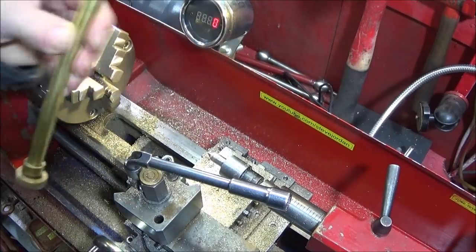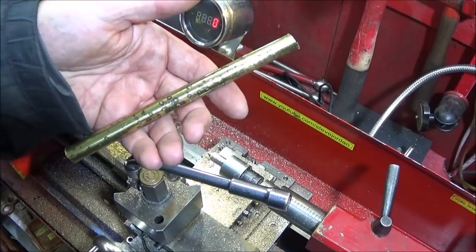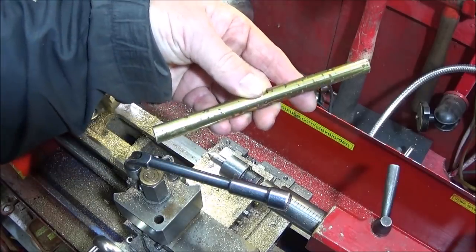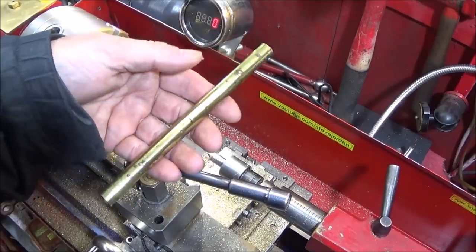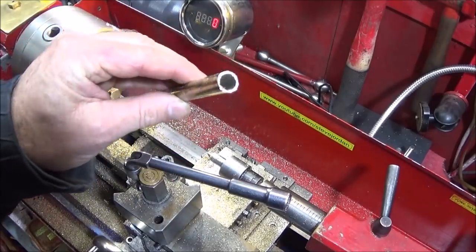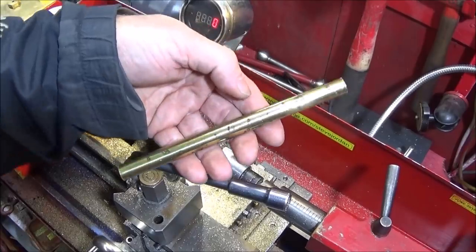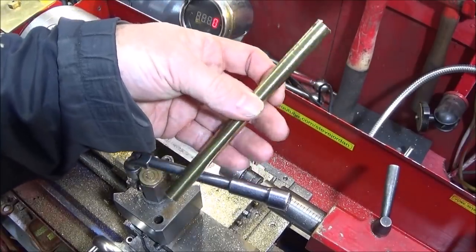With the brass one that I've made here, I find that this one is really reliable and goes off nearly every time. And I have actually seen some of them made out of polycarbonate or perspex, so that when the fire piston is used, you can actually see the flash of the ignition. And the most important thing about the tubing is that it must be a smooth bore. You mustn't have tubing that has a seam. And I have actually just ordered some stainless steel with these dimensions. It's very cheap to buy on eBay.